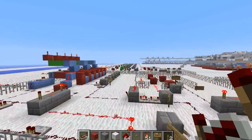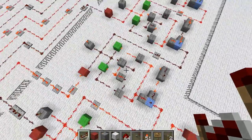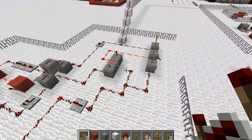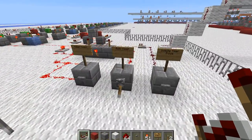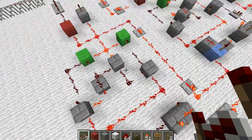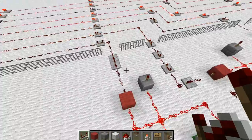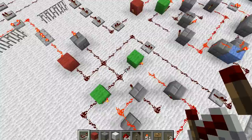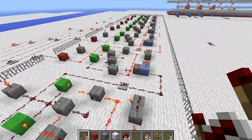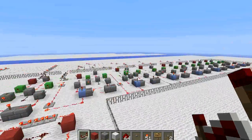The one I use for counting on the seven-segment display, which is this long one here, is basically a row of RS flip-flops or RS NOR latches. Basically what happens is when this one goes on, it sends the signal down there turning that one on, and then when it turns off it sends a signal to the next one telling it to turn on, and then when it turns off it basically ripples up like that. So yeah, that is it for the tutorial — I'll explain how to make this in the next one.